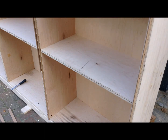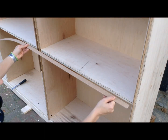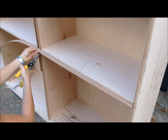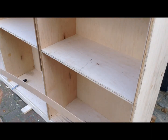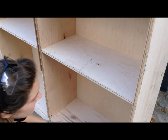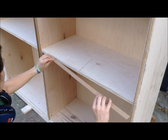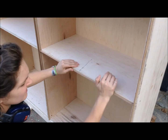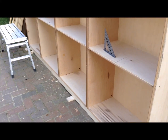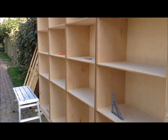With these strips ripped, I filled in the long verticals, and then for the horizontals, to cut them down the sides, I just take a guess measurement, and you could snip this stuff with aviator snips. And that will slide right in. So this is what it looks like with all those splines on.